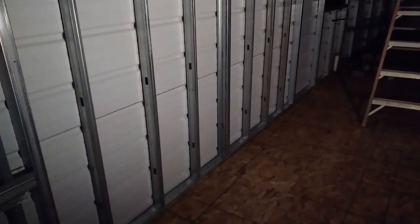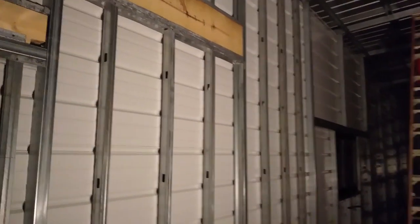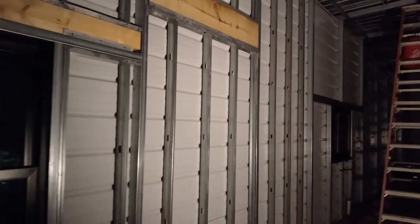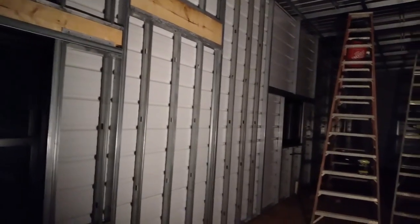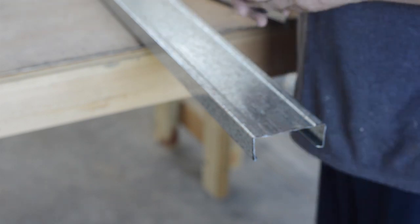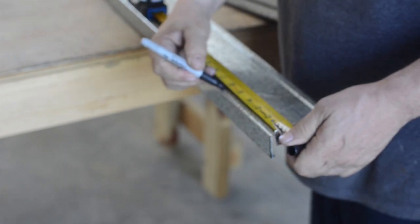We began with the inside of the exterior walls because we knew they should be square. Since the existing framework was made from 2x3 rectangular steel members, we had to use 2.5-inch channel and studs to frame up the walls for the sheetrock, aligning with the interior edge of the existing framing members. We put in wooden headers to attach hardware for doors or windows, and in this case to mount the interior head of one of the mini splits. Since the walls were tall, we used 22-gauge stud and channel rather than the normal 25-gauge you would find at a big box store like Home Depot.